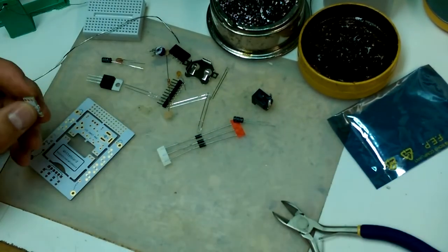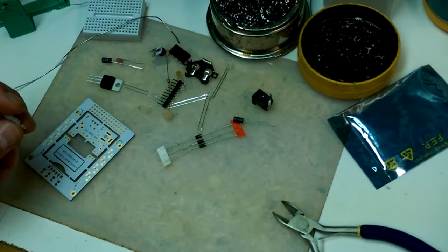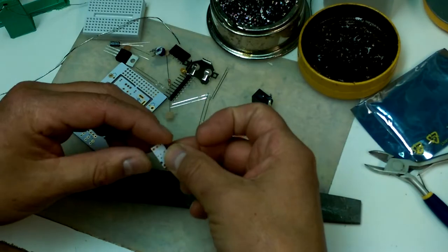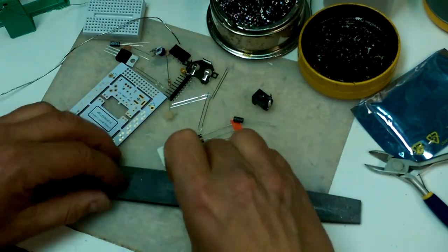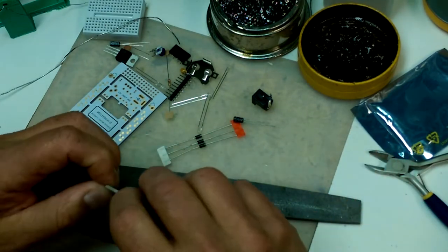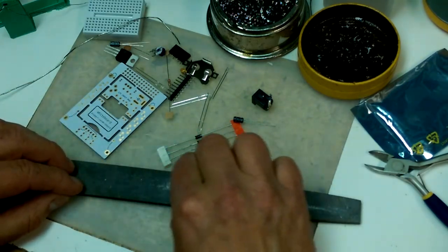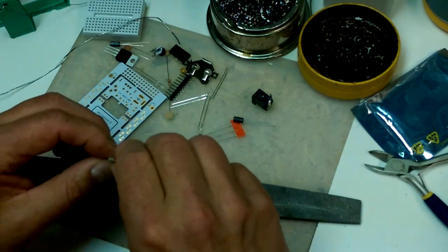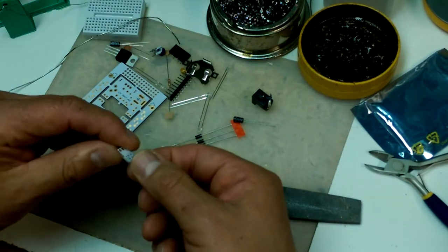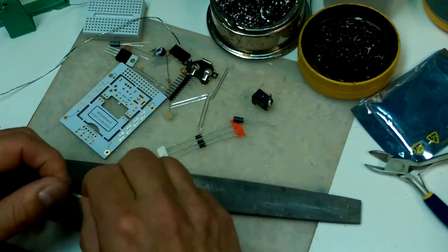Take the mouse bites off. Try not to aerosolize the board too much. So once you've done some smoothing, don't give it a good blow in order to clear off your file or anything like that, because fiberglass, you don't want to give yourself micro abrasions in your lungs, because that's scar tissue in your lungs, man. Oh, that's nasty. Nasty.